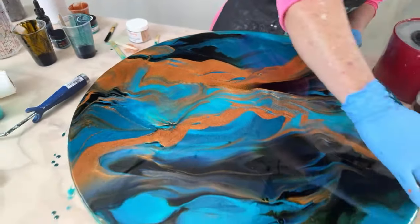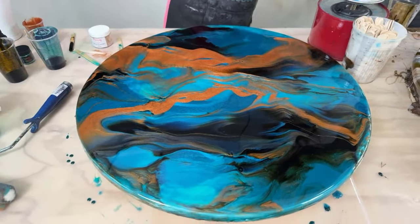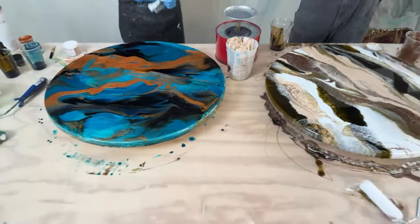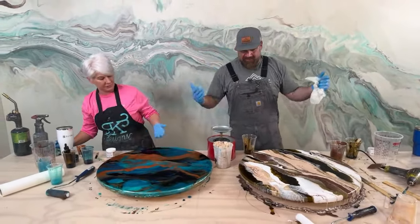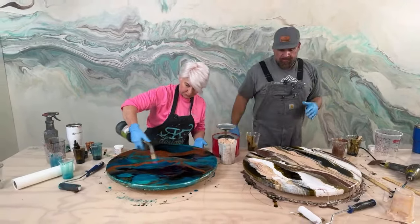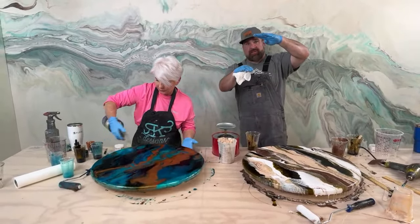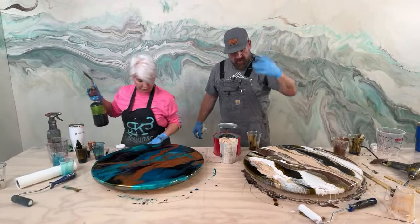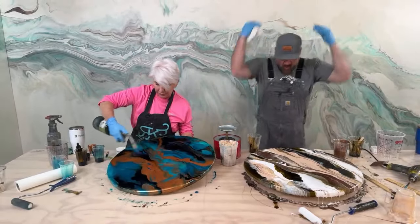Oh my gosh, look at this, y'all. This is amazing. I did a set of closet tables with this product, Rhonda. I just had 3/4 inch subflooring, I put a 2x4 on end as the bottom, and they're going in a garage. It was rough construction. I bonded the front edge, then I did a dirty pour and peeled that tape at 20 minutes. And my epoxy, 25 minutes, excuse me, the epoxy on that 4.5 inch edge looked like this along the whole thing, because as it thickened up, it didn't just all run right off.